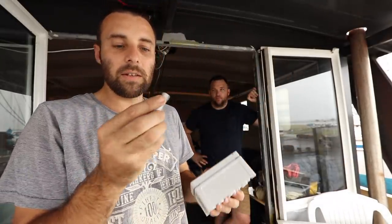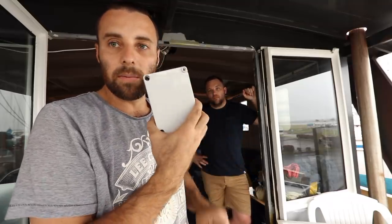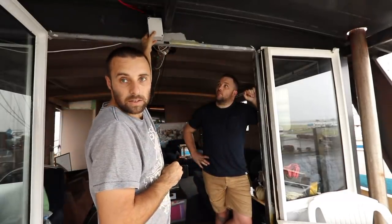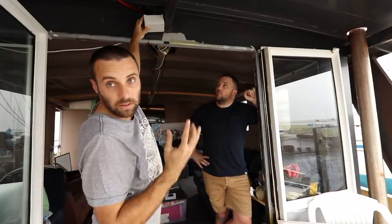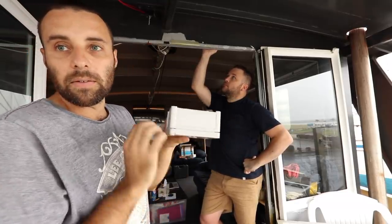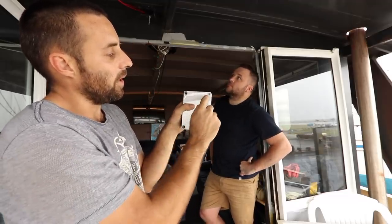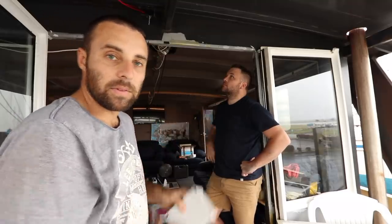It has these little plastic screws, don't know if they're awesome, that go in and do it up tight, so you end up with a Phillips head screw in the corner. The issue that we have is that because of the ribs in the roof, if we put that in that orientation, we're not going to be able to do the top two screws up. So we have to flip it and have it in that orientation so that the screws are from the bottom. The issue is that by doing it that way, we don't have enough room on the sides to get enough cable glands coming out of it. So I'm pondering how hard it would be to do it vertical. We'd have enough cable gland room on the side, but I'd have to modify a screwdriver and do like a right angle type screwdriver, some sort of arrangement like that, to do it up. Just wondering if that's even possible.